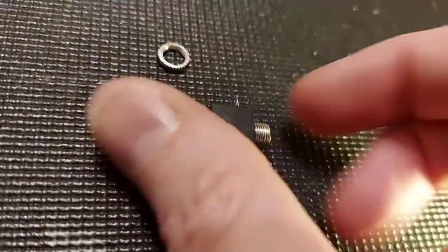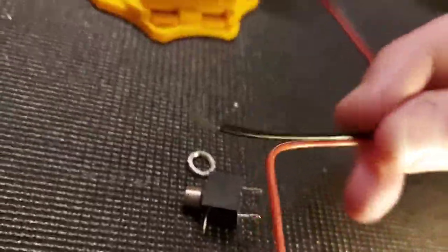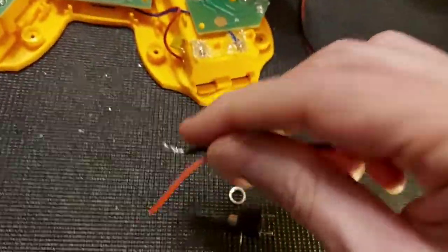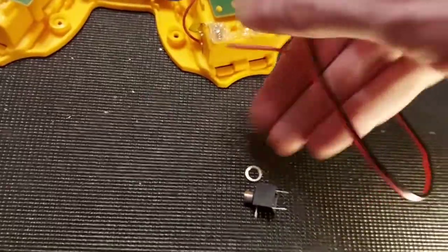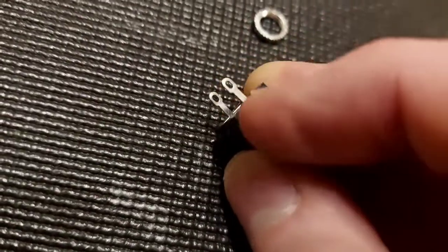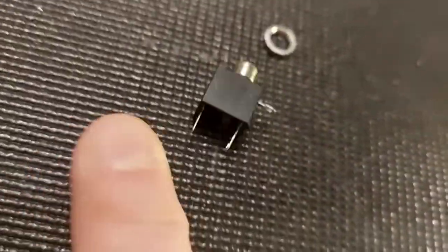We need the actual quarter-inch port, and you're going to connect up a couple of pieces of wire to it. Take a little bit of wire — it could be speaker wire, it could be project wire. I like to use wire that's connected together in the center. You'd snip this off, take a pair of wire cutters, and clean off the plastic on the end there. Strip it until you have a little bit of the metal. You can twirl it in your fingers to make a nice neat little end. You can either twirl that end around the little holes at the end of the port, or you can put them on with solder, or do both — probably safe to do both.